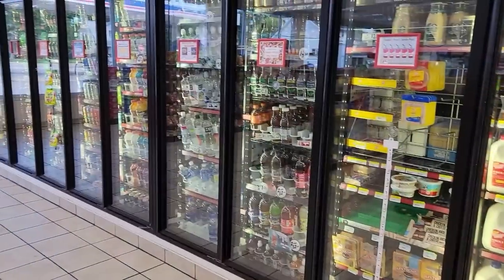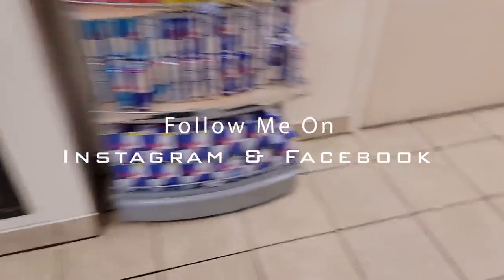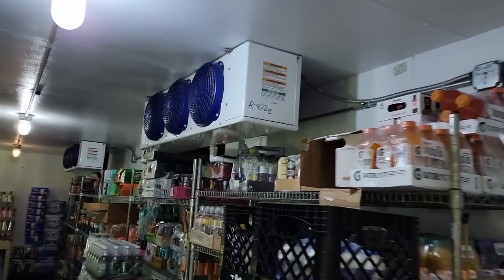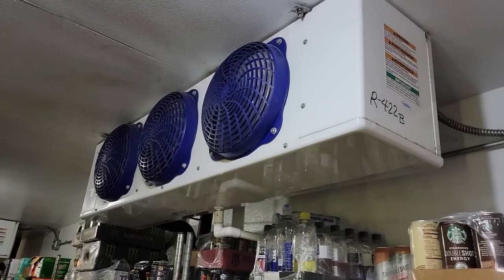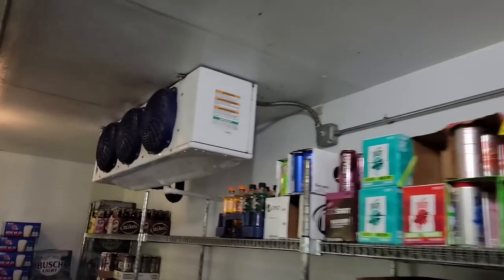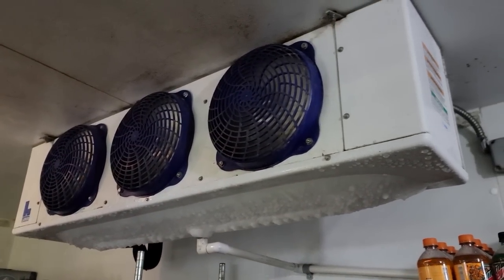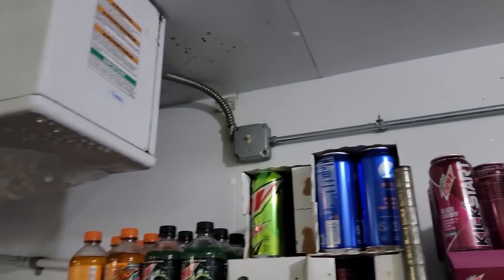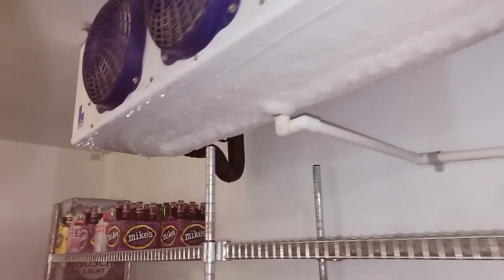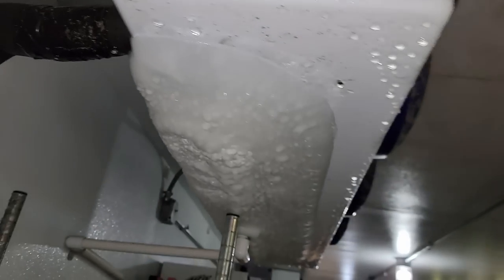What's up guys? We're working on this little row of cooler doors and we've got a problem today. The initial problem was the customer had this particular evaporator freeze up, so what she did was turned off the fans — which are both together in parallel — and the system continued to run. They left it off for a week, and it got worse than what it was originally.